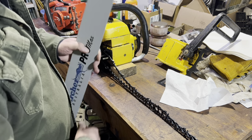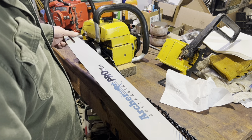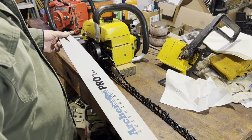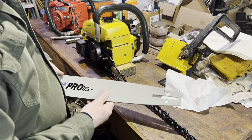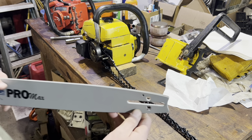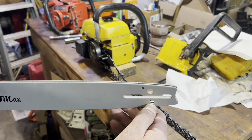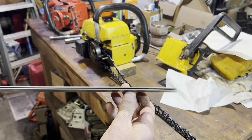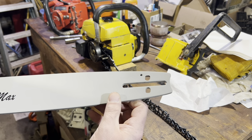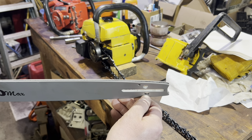That's why I went with this bar — it was the largest I could find in the Husky small mount for 28 inch. I could have got a large mount and made that work, but this comes out a little bit nicer. Take a quick look — see how I've cut through into the groove. You can see right through, you can see daylight in there. I did both sides so I can flip the bar, but you have to make sure and open that up.